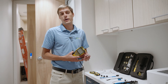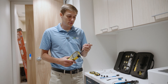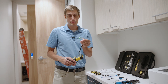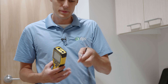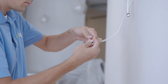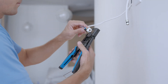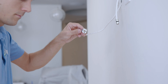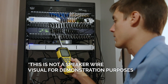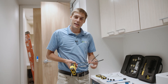For example, we like to wire in speaker systems. When you're wiring in your speaker systems in sequence, you need to make sure that you tone it out so you know which cable is which when you're patching into the volume control. So I made a typical male connector crimped into a cable, then split open the wires. What I did is just tap one side on the red, one side on the black, then push the tone signal button and it will tone out to the speaker so you can hear it ringing and know that your chain is complete. Just something not included in the kit, but super easy and useful.